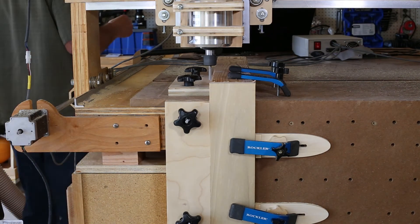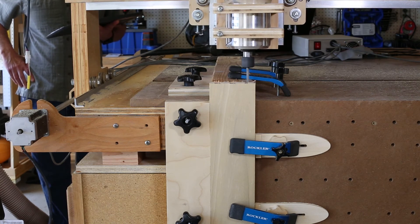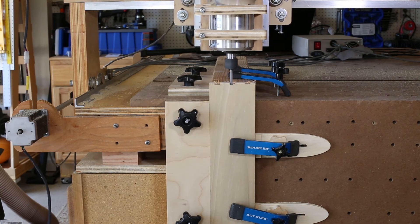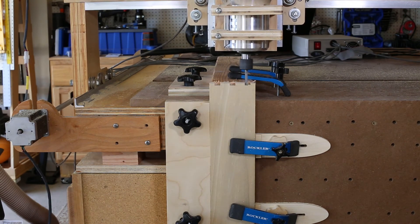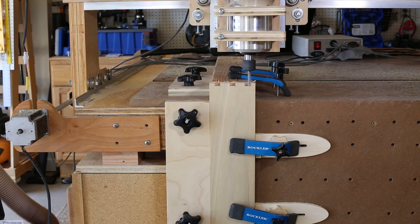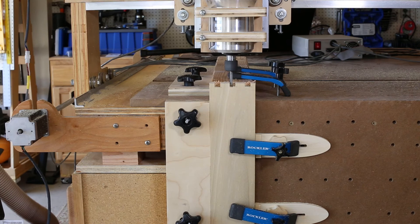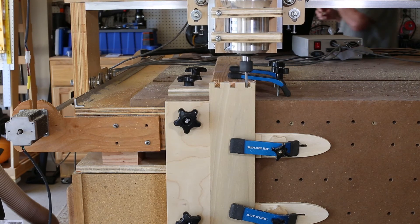This video portion shows using the same straight bit to hog out the rough cut for the dovetail bit. The reason is you can't use the dovetail bit for a rough cut — you get one cut with that dovetail. When I'm using the dovetail to cut through that board, I want to make sure most of that wood is already gone so I don't stress out the bit. I really don't want to make a cut that's three-quarters of an inch deep across a three-quarter inch board without taking out some material first. That's why I do the rough cut first and then come back with the dovetail bit.